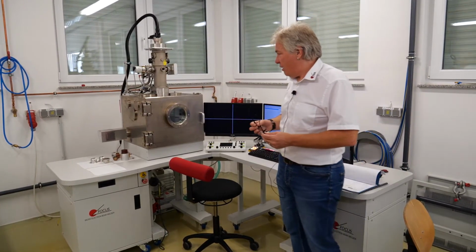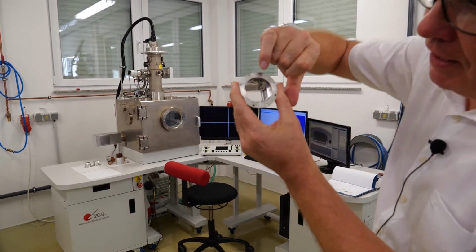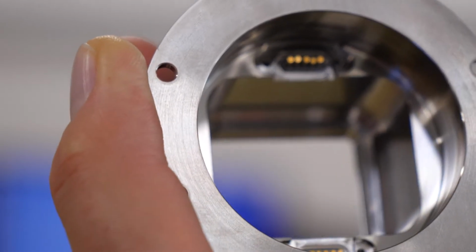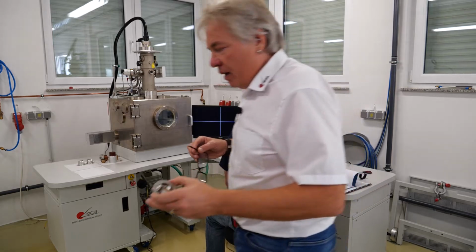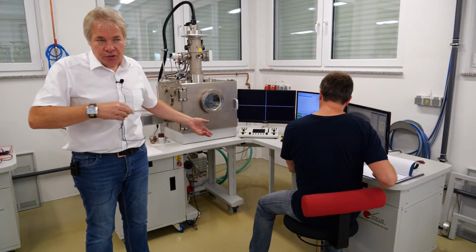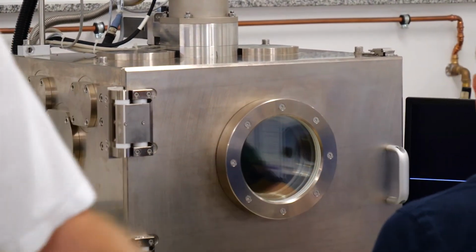What we do have here is a special item. You can see inside here maybe 5 electric pins, which are part of a ceramic, Kovar surrounded or stainless steel surrounded, which needs to be welded into this housing here. This ceramic inlay is something Thomas needs to weld anyway for a customer. So we said, let's do this and use beam deflection in order to do this welding. The dimension of this electrical feed-through, I'd say the length is maybe 10 to 15 millimeters.